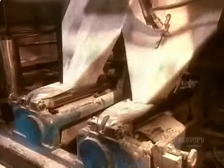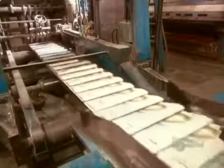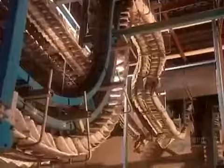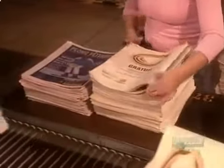Each line of the press prints a four-page flat, then it cuts the sheet in half lengthwise, separating two and two. Then it cuts the continuous lengths widthwise into a two-page spread. Machines automatically assemble the pages in order, then send them off to the shipping department. The stacker makes piles of 50 copies for delivery. Then workers hand stuff the inserts one by one.